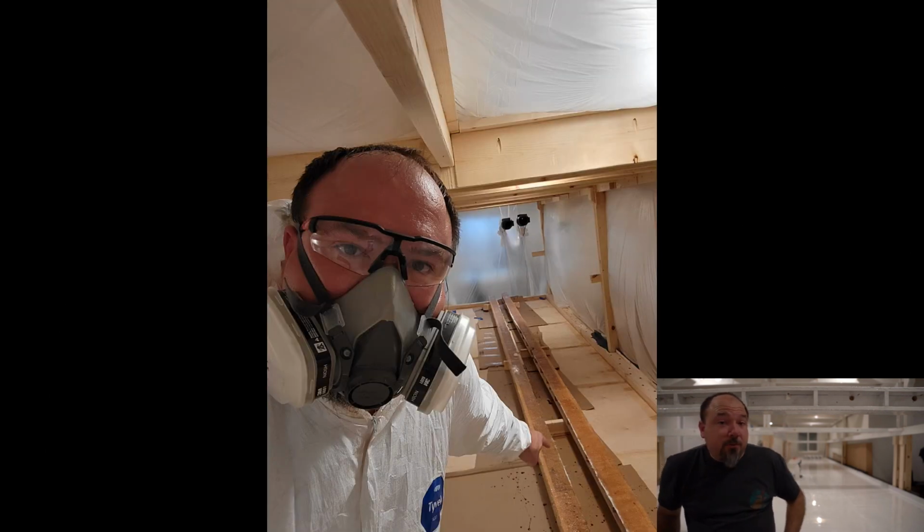Once DIY wood filler was completed on the bottom, I moved on to the exact same technique for fiberglass on the 24-foot and 30-foot beams. At this point, using resin in the basement had really necessitated the need for the second ventilation fan, which brought me up to 410 CFM of airflow through the tent, and it worked like a charm.